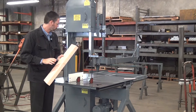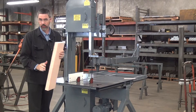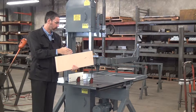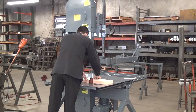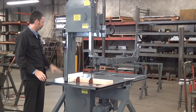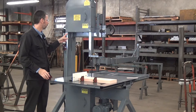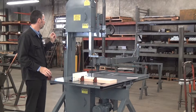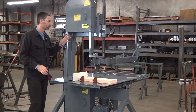I'm going to do a couple cuts here. First, I'll do just a little snip through a one and five-eighth inch thickness, just to show how it cuts. Then I'll set it up on end and do what's comparable to a resaw cut — cut through a more substantial amount of material. The machine I have to work with today is a model 204 vertical saw with a traveling table. This machine has pneumatic blade tensioning. Today we're running a one inch wide, three tooth per inch blade, running at a speed of about 3,000 feet per minute.